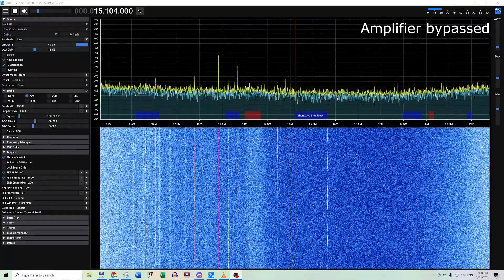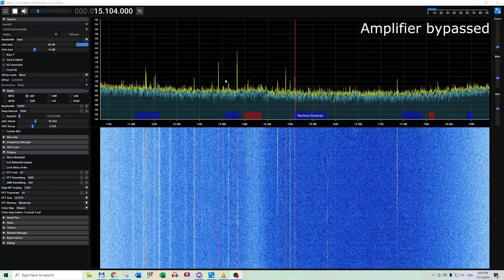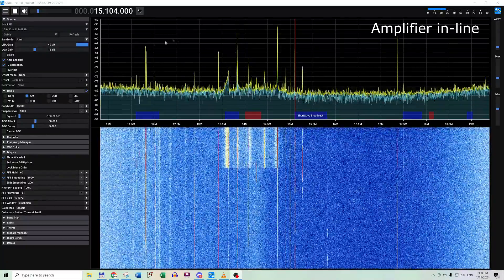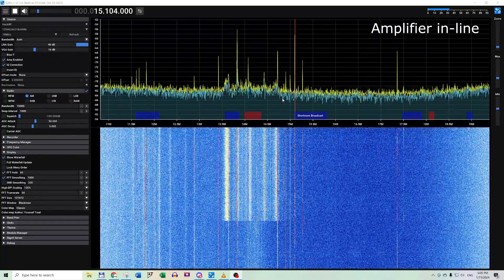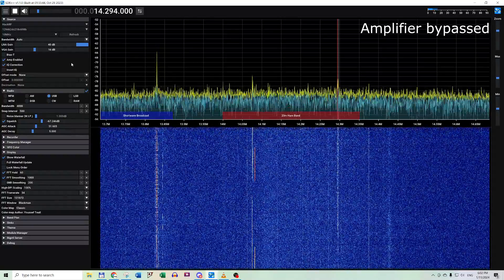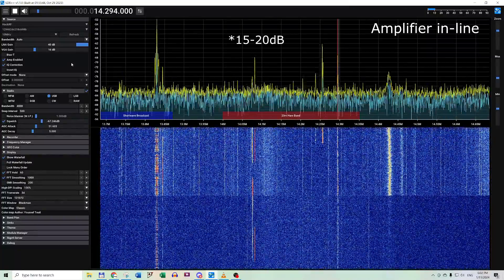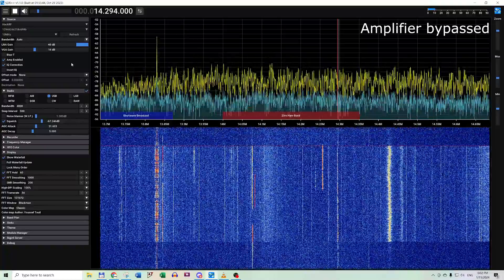With everything fired up, we can have a quick look at the wideband performance, mainly of the filters. We can see that most of the RF spectrum is clean, other than some spikes appearing here and there, mainly around the filter's center frequency. When I turn on the amplifier, we get a very clear signal boost, only in the passband region, again confirming the filter's utility. You may already notice the useful signals jumped up a bit. Zooming into some radio traffic, turning the amplifier on or off has a very clear impact — the signal is boosted by about 30 dB, but we also get a boost in the noise floor of just about 5 dB.